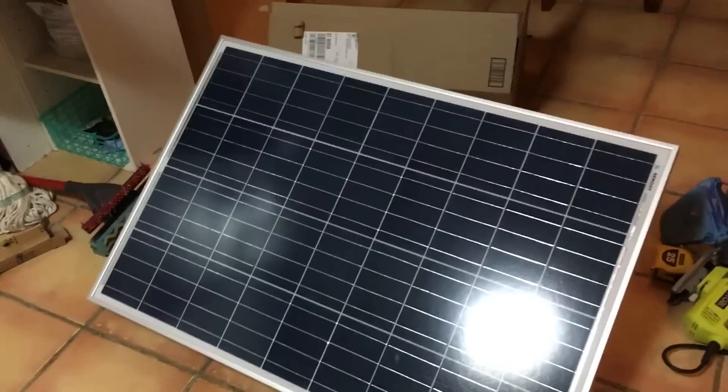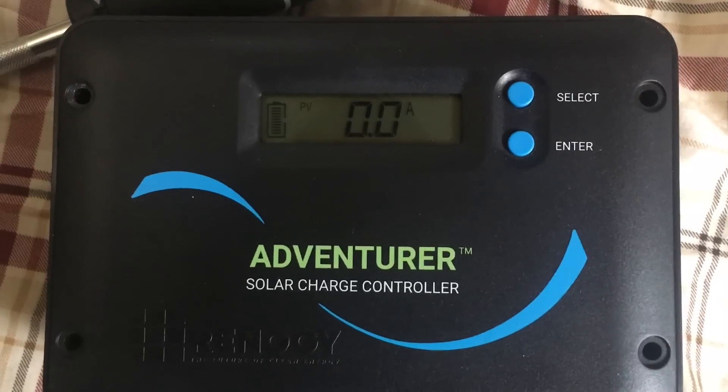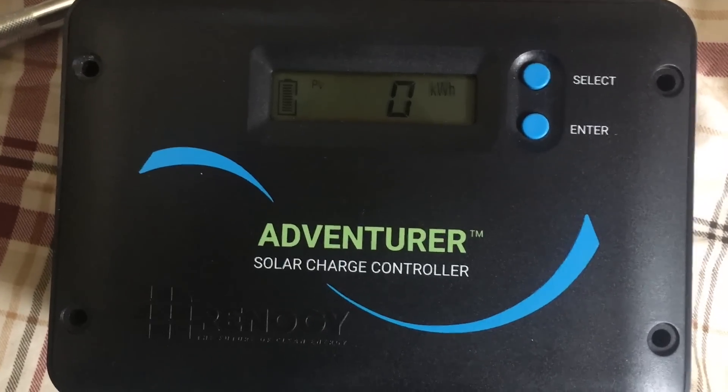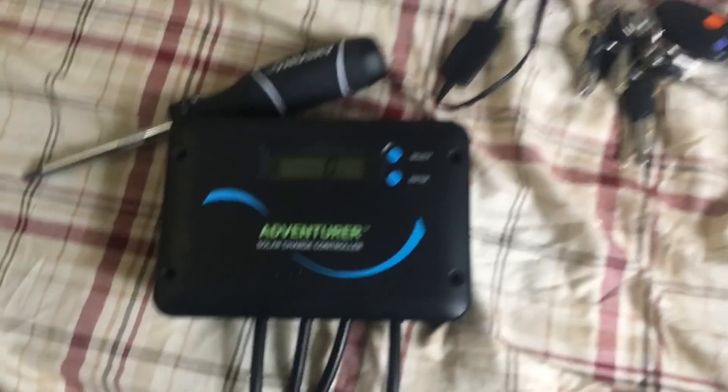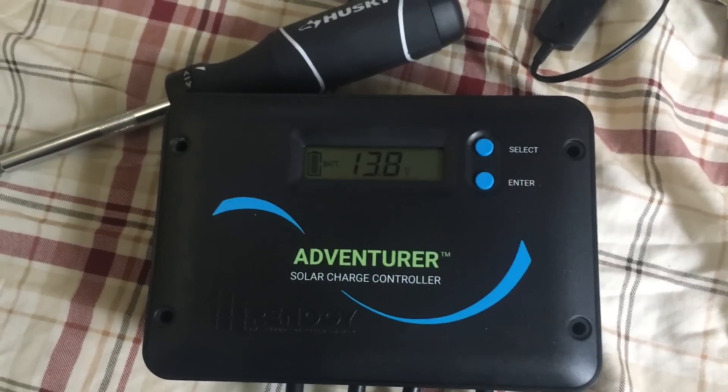Tomorrow I'm going to hook it all up and we'll see how everything goes. Okay, moment of truth — I've set up the solar panel, took me a couple days. It doesn't take two days to do everything, it's just back and forth to Home Depot. So now we get to see if everything works. I'm going to plug in the solar panels and we'll check the voltage. As you can see, panel voltage is at zero. We're going to connect the solar panels and see if it draws a current. If it doesn't, it's a sign that I have the polarities mixed up. So let's do it.